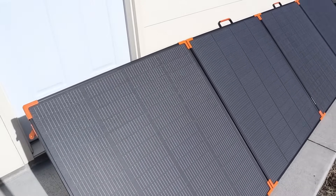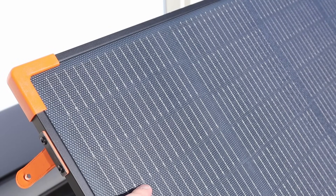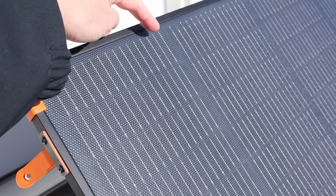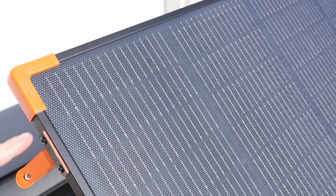Let's take a closer look at the solar cells and see what technology it's using. You'll notice that this uses an ETFE coating and is IP68 waterproof rated. As for the actual cells, they use N-type cells with 16 bus bars. You'll also notice that they are chopped into thirds — so these are third-cut cells — and that tends to help with partial shading performance.